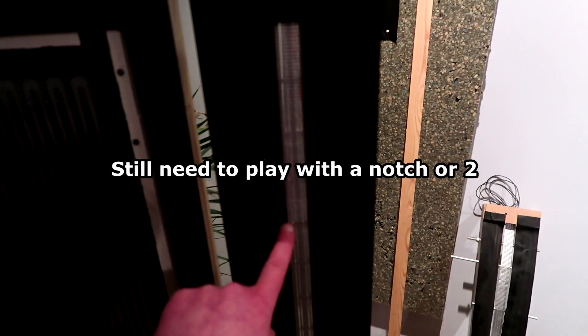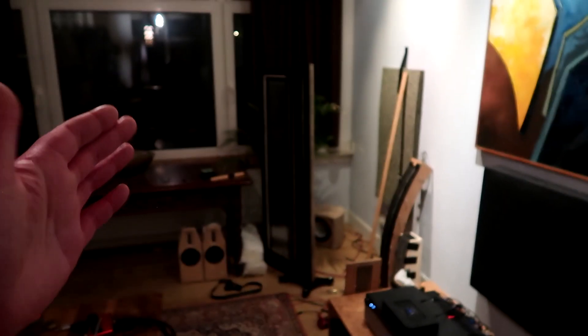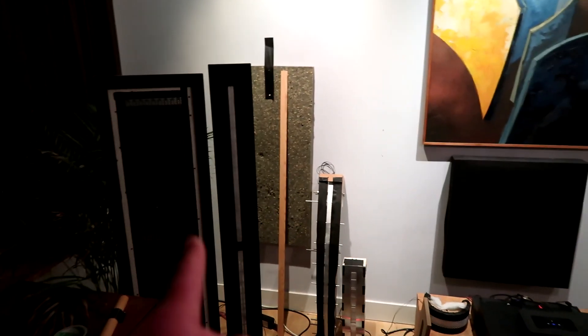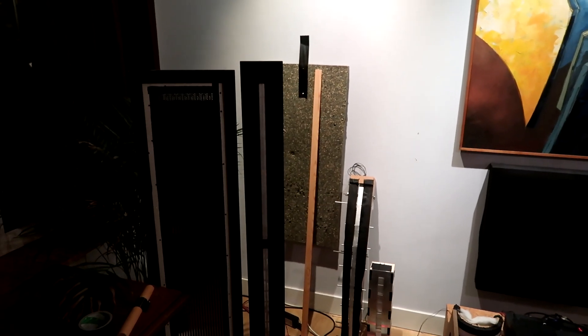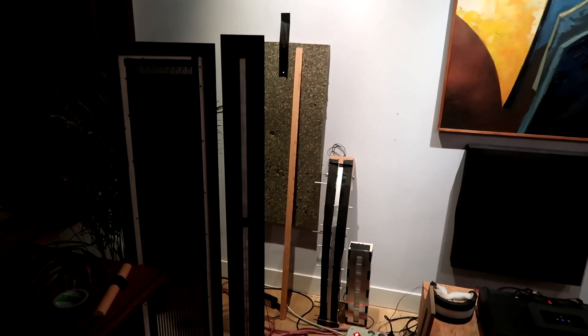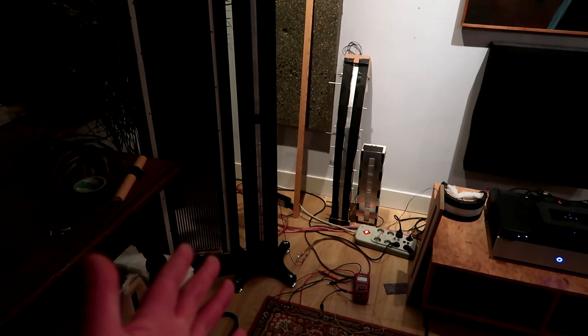Except this tweeter still has problems with efficiency — it's lower than the other one. The reason is hardly visible: this one is almost butt up against the wood. That means it's further away from the magnets. Here there is a space as it should be. I don't know why that frame doesn't work — I cut both of these top sides from the same plate. What I'll do tomorrow is change out the foam again on this one and reverse it: thick foam on the front, thinner foam on the back, and hopefully get it a little bit closer to the magnets without touching, and get my 3 dB difference back. Then I have to do the bottom side and I don't know — that might be having the same problems.